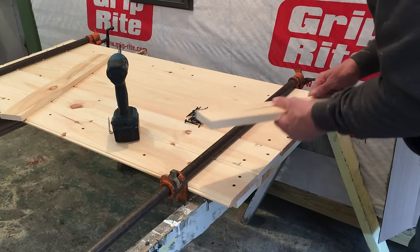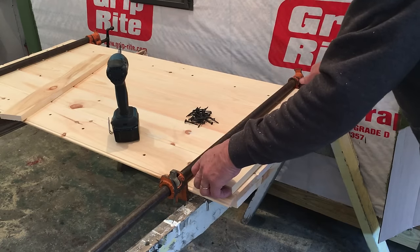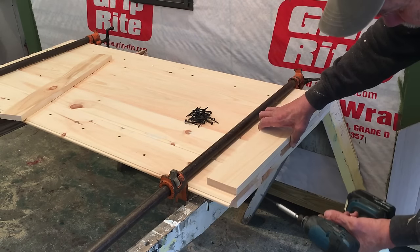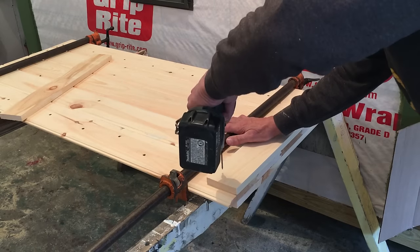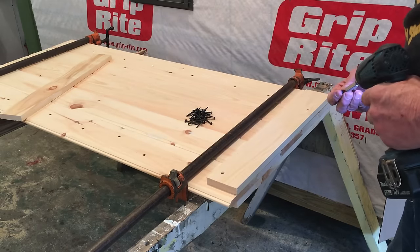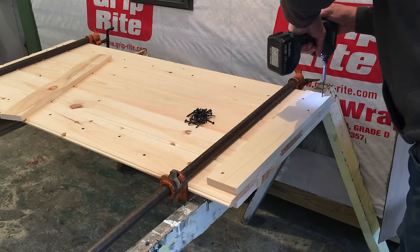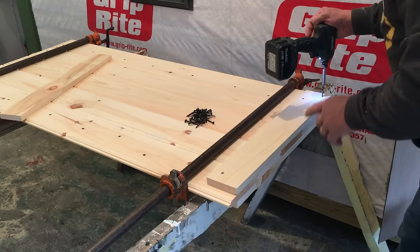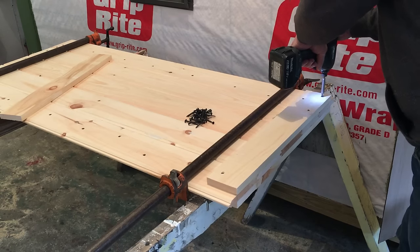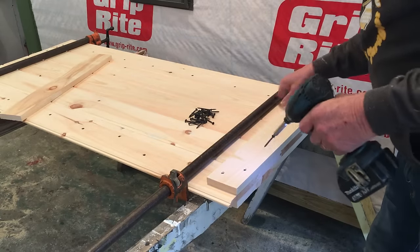I want to tie these all together top and bottom, so I'm picking a good side of the wood. Using two-inch screws now to go through the three thicknesses. This will be the finished inside, so I'm going to try to do a kind of a nice pattern. If you run the screw in reverse, it pre-bores the hole for it when you're out near the edge of the wood so it doesn't split. And I've clamped it so it's all good and tight.